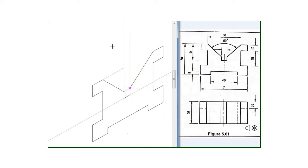Then I will complete my drawing by making these lines dark lines and erase the construction lines so the drawing won't look complicated. Now with this part I'm done with the front view. What I have to do now is to draw every visible line using this 85 millimeter to this side. So I will start by transferring this point with 85 millimeter, and also this one with 85 millimeter, and this one with 85 millimeter, and also this one with 85 millimeter.